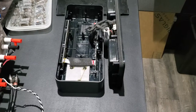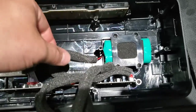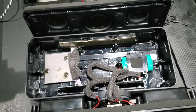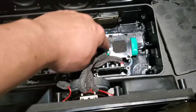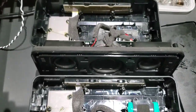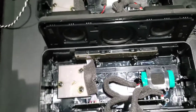This is a brand-new stock unit from DOSS. You can see the battery pack — it has a foam-padded cable that runs around to the circuit board and plugs in. What I found on these units is you can't simply remove the battery pack and have the unit work. It's a 2S 18650 battery pack with a small BMS board inside the plastic wrapper. On my failed unit, the BMS board had failed — it no longer had any power output. I verified both cells were good, but the BMS had failed.